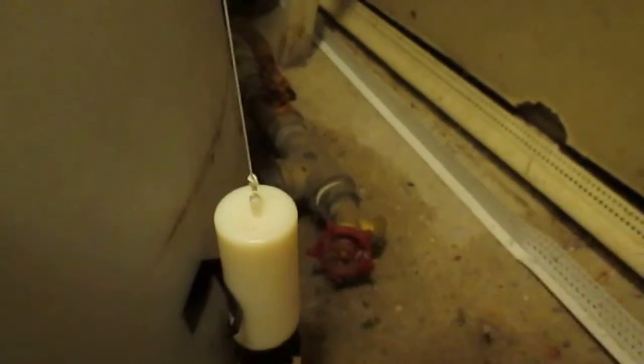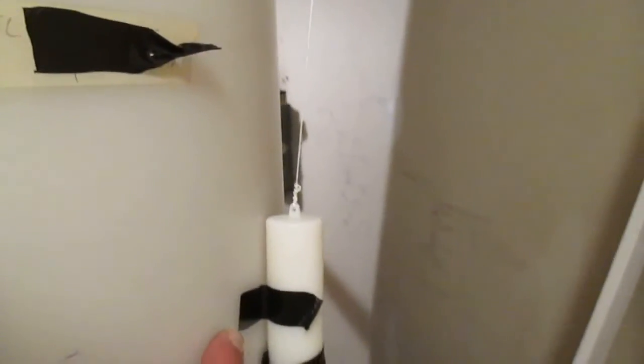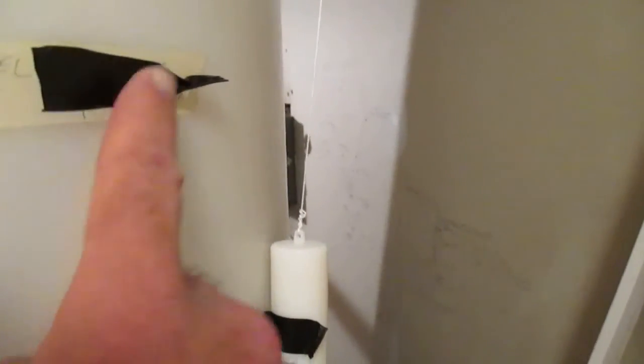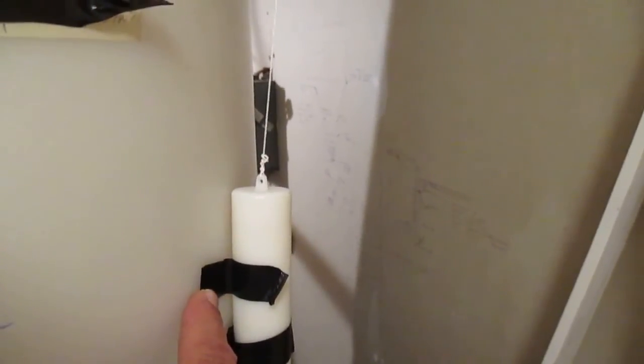Now, I'm not gonna make you watch this part of it. All we do is go back down to our float and raise it up, not exceeding that 10 centimeter per second rate again. When I raised the float back up, the instructions told me to take it to the 90% full mark. Now here's the 100% full, and that's what I was calculating, roughly at about 90%.